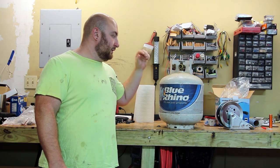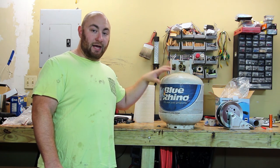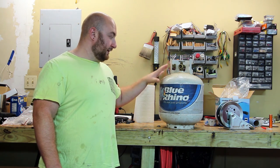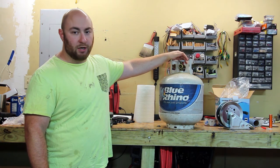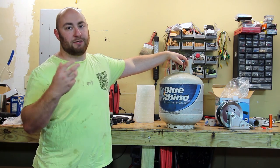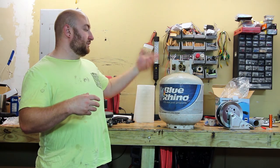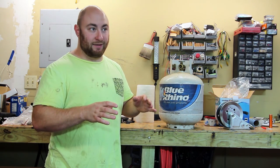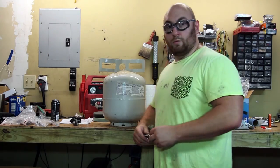A few boilerplate things before we get started: propane tanks contain a combustible gas under pressure. The last thing you want to do is cut into this with a plasma cutter or a grinding wheel because you're gonna set off a spark, it's gonna ignite, there's gonna be an explosion, and you're gonna get hurt. The first thing we're gonna do is take this valve off and fill it with water. Propane is denser than air — if you take the valve off, the propane won't rush out; it'll sit in there. But water is considerably denser than propane, so if we fill it with water it will displace all the propane out into the atmosphere. Do not cut into this or any other container designed to hold compressed gas, flammable gas, or flammable liquid — it will blow up in your face.